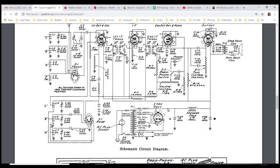At this point we have some high voltage — something above 230, maybe 250, 260, or 270. It comes into this filter, goes through the speaker field coil which chokes out more of the hum, then another small filter capacitor. And then we have nice, smooth, high-voltage DC ready to run the tubes. From here, the voltage is fed into each tube — into the plate, and maybe the screen if it's there.